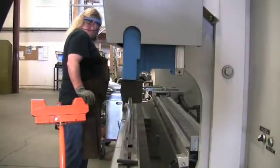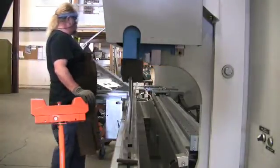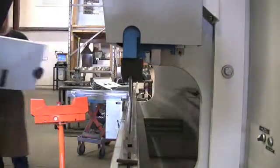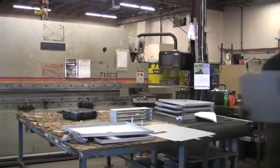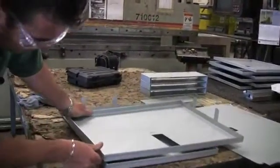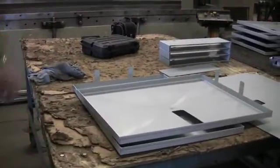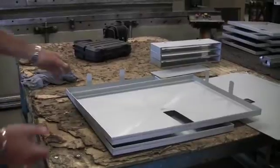Z1 and Z2 move over to the left for this bend at the far left of the machine. This is a really nice stage bend part. It goes back, fingers come back to the center of the machine, ready for the next part. Once again, identical part — great corners. This one has just as nice of a corner as the one before it, and they all will. Great fit downstream.